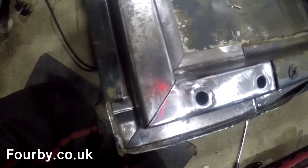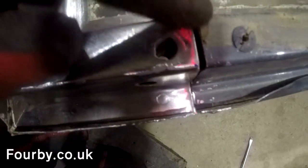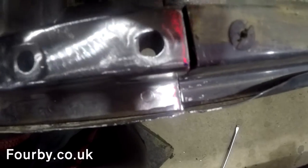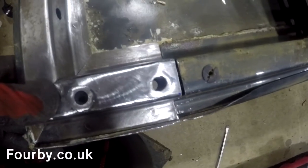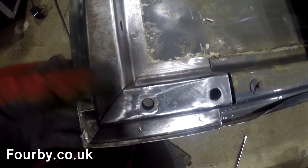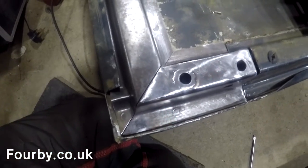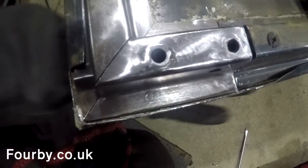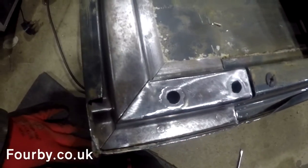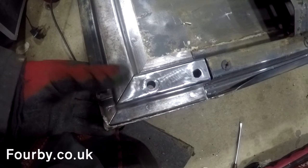That fits — that is about as good as I could have hoped for. We've got a bit of a gap there; it was very difficult to get a very straight cut on that piece, but the mitre is good, the offset in the corners is good, and I'm happy with that. I'm not going to weld it up tonight though, because I think I'm going to get some sort of glue to bond it. I also need to cut the other side and get that side mitered, then we can weld around here, maybe brace it — I'll get some angle iron and brace it, clamp it up so it's all nice and straight. That's enough for tonight, thanks for watching, I'll catch you on the next one.